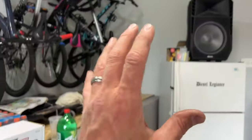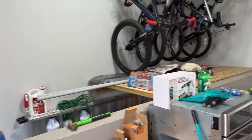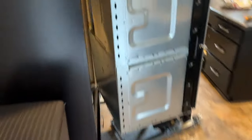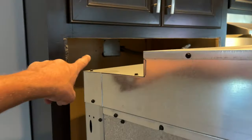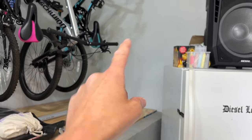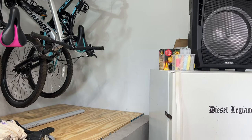That way I'll only need about five feet of wire, plus the transfer switch box, outlet box and switch. I'll cut them right into the wall and screw them into the wall stud. This is just going to be a temporary 220 line for occasional powder coating. I went ahead and pulled my double wall oven out of the cabinet to see where my outlet is, took some measurements, and found exactly where the main line runs.